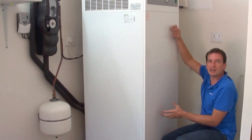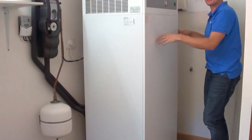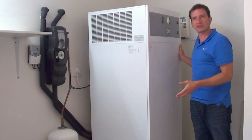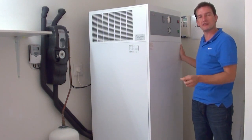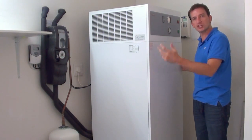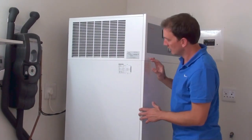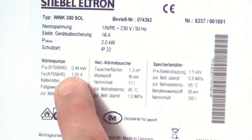If you keep the two systems insulated together in one unit, you also have less heat losses between the heat pump and the tank. This is as close as you're going to get to a pure refrigeration heat pump system. When people talk about a 75% heat pump saving, that is a theoretical saving for an ideal integral refrigeration system. The minute you split the heat pump and put the tank separately, your efficiency drops because of the circulation of water to the heat pump and back.